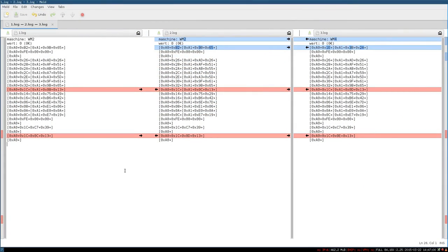So these are the traces which I made using the Bus Pirate and my proxy card when I plugged my card into the washing machines. My card had 0 euros on it, or 0 points, and this is what you see on the three traces. I first plugged it in machine number two. I replugged it in machine number two to see if there's any difference, and in the end I plugged it in another machine, machine number four.